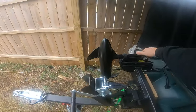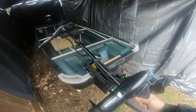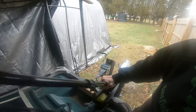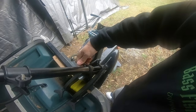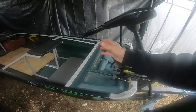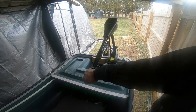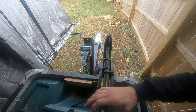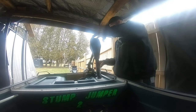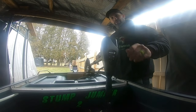We bought a cheap 55-thrust Newport motor — it's a transom mount motor, but we just took the screw out of the back and flipped it around so now we can use it as a front motor. It's mounted here to the side. You've got to move it out of the way when you take the boat off the trailer so you don't hit the prop. Just slide it forward, loosen the screw a little bit, slide it forward. Whoever's in the front of the boat pulls the handle out and you can adjust speed. When you're done for the day, pull it back, crank it down, and that's it.